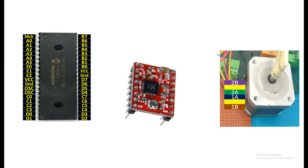To power up this motor you can use an external battery of 8 to 15 volts. I suggest you do not exceed 8.5 to 9 volts for this cheap motor driver because it may burn the IC; with a heatsink you can go up to 12 volts. A separate supply is used because you cannot power up this motor using the PIC's power supply — it will starve the PIC and the PIC will keep resetting. So you will have a separate low-voltage power source for the PIC which also powers the A4988, and a high-power source to power the motor.